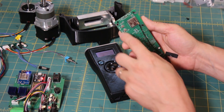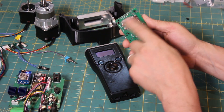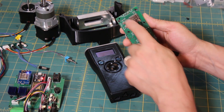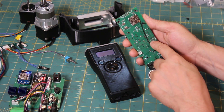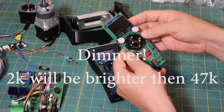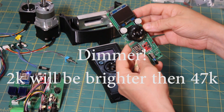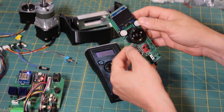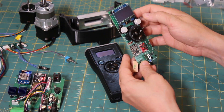I know the recommended resistors for the linked mode are higher than 2k — I think 47k. Each button is individually addressable with a resistor. Note that more resistance actually means dimmer LEDs: at 47k they'd be dimmer than with these 2k resistors.